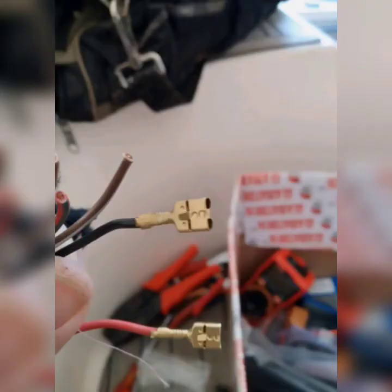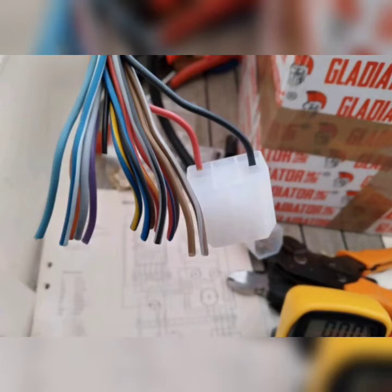So, as I said earlier, the first thing that we do is to take things one wire at a time. In this case, 2 wires at a time, the positive and negative wires to feed the panel with electricity. This is a 12 volt panel. We would do exactly the same if it was a 24 volt panel. We take the positive and negative, and then we put these into the correct socket in the 11 way, according to the Dragon Marine Systems wiring diagram that came with the panel. This will be a different configuration to the Volvo panel, so we cut the old 16 way off.